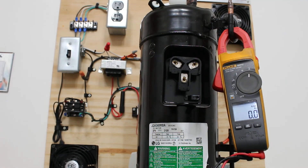We just learned a few ways on how to check a compressor electrically — specifically, we were checking the windings inside the compressor and the insulation around the windings. Many of you are probably wondering why this compressor was deemed bad. We only checked the compressor electrically, but this compressor mechanically failed. To check that, we're going to go back to our multimeter and set it to amps — checking amperage AC.